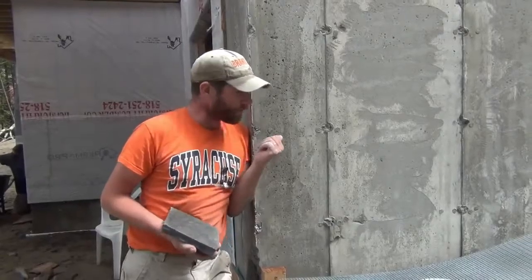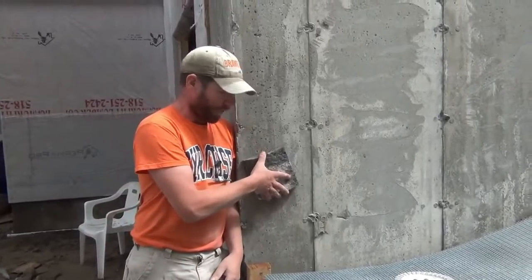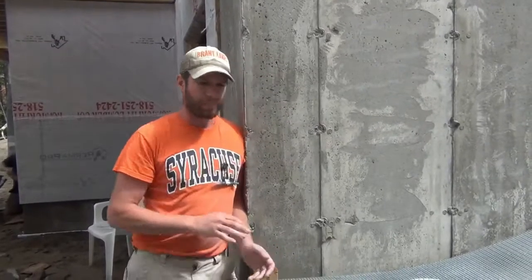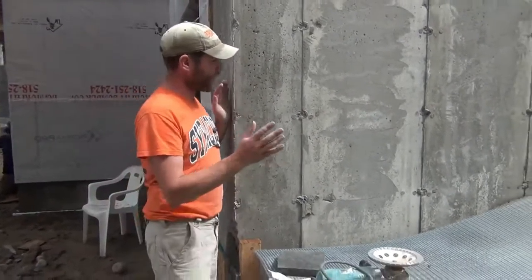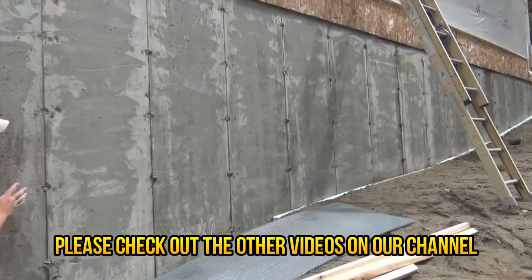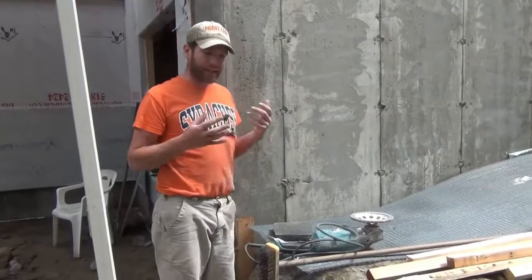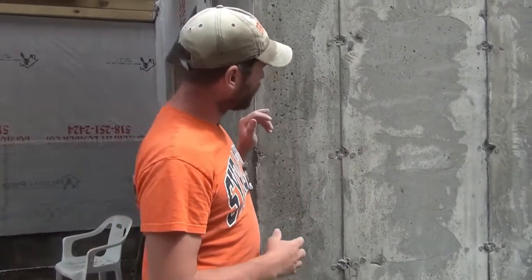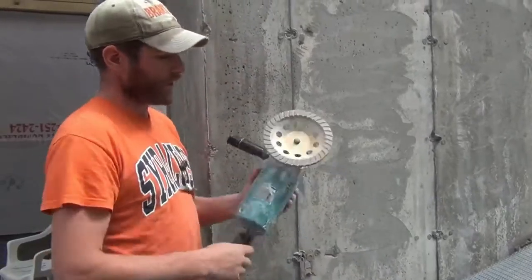Hey guys, I want to show you how we prepare our substrate for applying a stone veneer or cultured stone. You can't just lick it and stick it on the wall — the walls need to be prepared. In other videos we show how we make our mortar, but none of that matters if you have a beautiful brand new form-poured concrete wall, because on the inside of a lot of forms is form oil. When the concrete cures against that form it's often too shiny and just not something your mortar can bite into. So what we do is take a cup grinder — I'll put links to all the things we use in the Amazon link below.